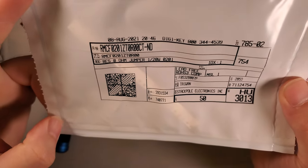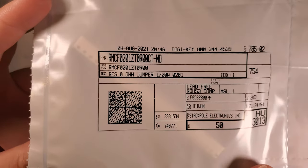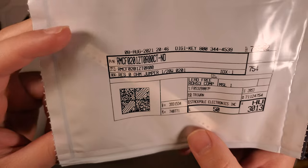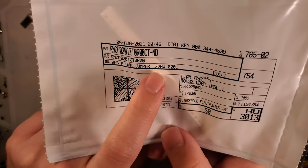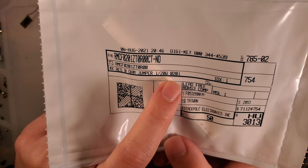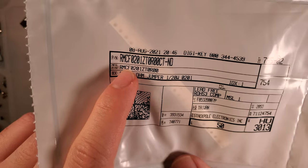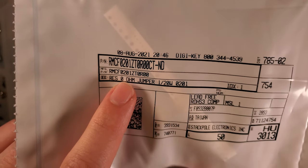I will throw a link to this in the description. I am fairly confident it is the right part, or at least it's right enough, but this is a 0-ohm resistor rated for 1/20th of a watt in 0201 package. The specific part number is that mess right there, but again, I'll throw a link in the description.